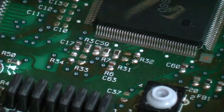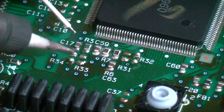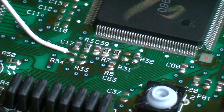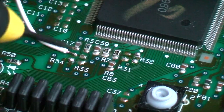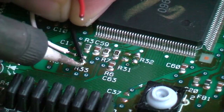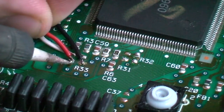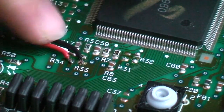We'll do our 50 and 60 hertz switching first. We'll attach the white wire, and as I was saying, that goes up into the top row. These two contacts at the top are joined, so it doesn't matter which one you attach to — just go with whatever's convenient. We'll get our white wire attached. Then all we need to do is attach our five volts and ground. There's a marking on the board here that's got R33 — the point just above that is ground, so that's where we're attaching our black wire. And the one next to it with R34 written next to it, that's where our five volts comes from.